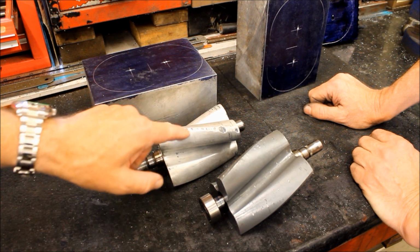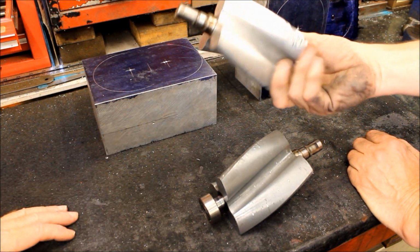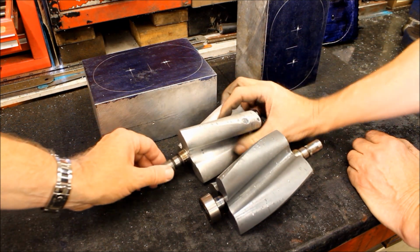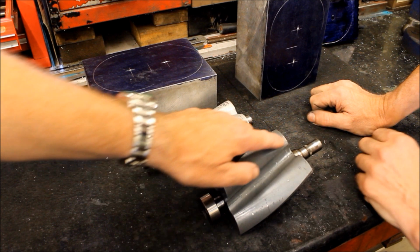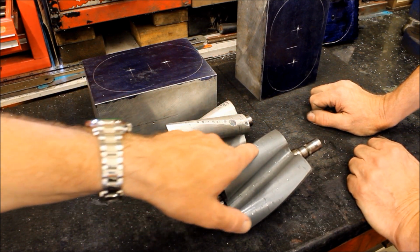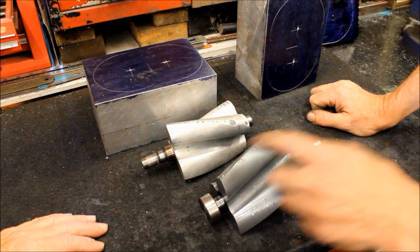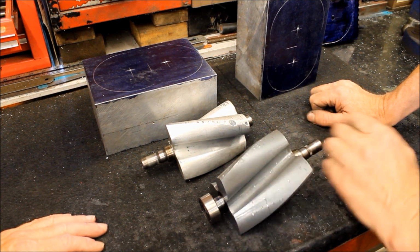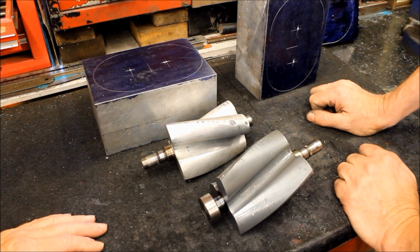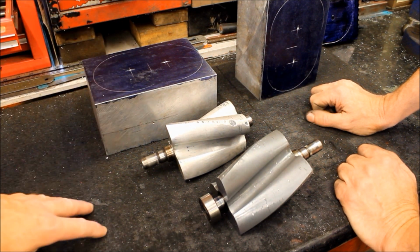But what's the point? Because it's actually so knackered, that's not going to seal, is it? Well, it's a test piece. You reckon you can take the Teflon off this, and it'll be quite decent. What you will find is you may lose a couple of thou off the tips when it interlocks. If you're running fuel through it, it's not a major problem, because the fuel helps to seal it, which you don't do on standard applications.